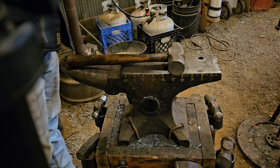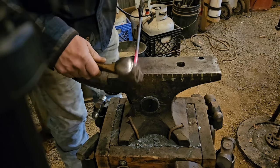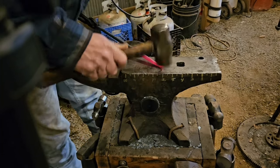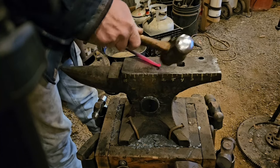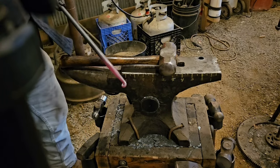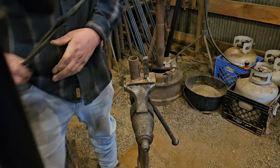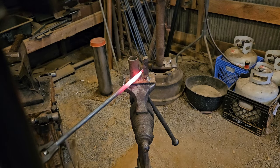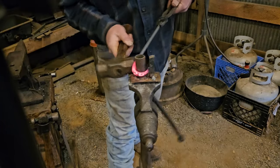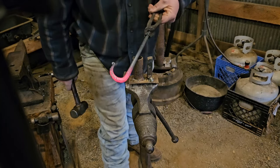Just a few seconds to heat it up for the scroll. We've got our scroll end in — it's time to use our jig. I'm going to dip the scroll in to cool it off so we don't mess it up, then just hook it in right here. Come around — I've got a nice half circle. And there's our hook to hold the curtain rod.